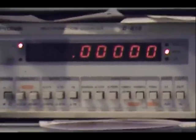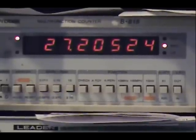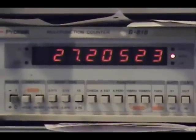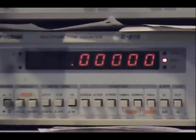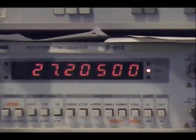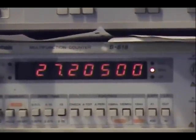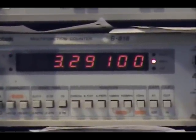Let's check how close it is on frequency. With the mic gain off, it comes out of the box at 27.205.24 MHz, which is not perfect but acceptable for AM. I like to bring things closer than that. After adjustment, we're at 27.204.99 — almost right on the money, basically perfect. That just makes me feel better knowing it's right on frequency.